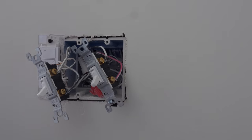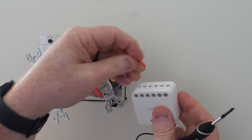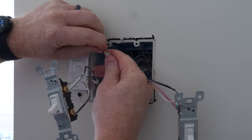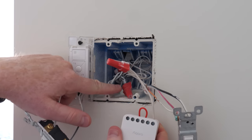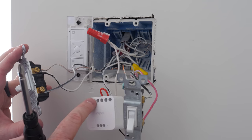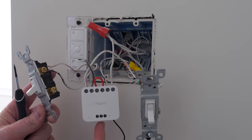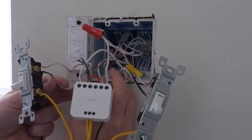First, take a picture of the existing wires to remember how they're connected. Then short the relay by unscrewing L out and L in, placing in the jumper, and screwing it back together. Next, add a pigtail to the neutral bundle and attach that to the T2, then attach the line to the T2 as well. For the load, attach load one and load two to the relay. Then attach the switches to S1 and S2, and connect the two lines from the tops of the switches together into the COM port.